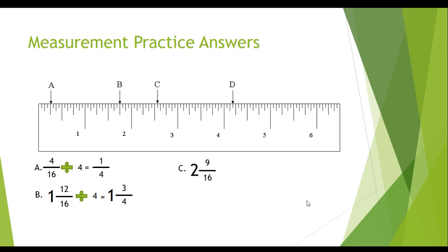The last one, D. We look at where D is and see that the previous inch is 4. We're going to start our fraction by putting 16 with a fraction bar over it. Then we start counting with the first small mark after the 4-inch mark — that small mark is 1. We count 1, 2, 3 and write down 3. We have 3 of the 16 equal pieces. 3 is an odd number, so we know it can't be reduced — just like the answer for C. So that measurement is 4 and 3-sixteenths.